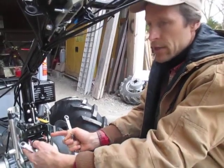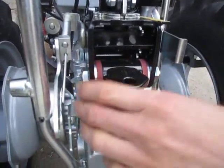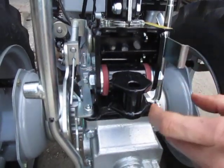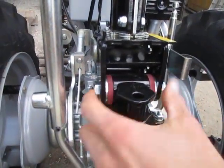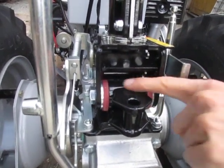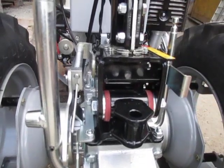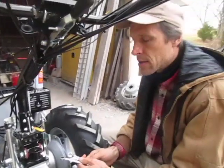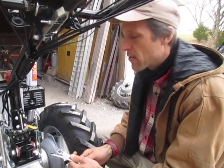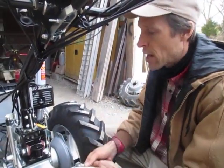You can also check these great big nuts and bolts here. These link the base assembly with the pivot post assembly. These nuts and bolts actually run through rubber mounts — you can see the rubber here, there's rubber that goes all the way through that piece of tubing, both front and back. There are two of these. They're not very likely to loosen up, but it's good to check them every now and then, maybe every five years. Just put a big wrench on each end and check them.